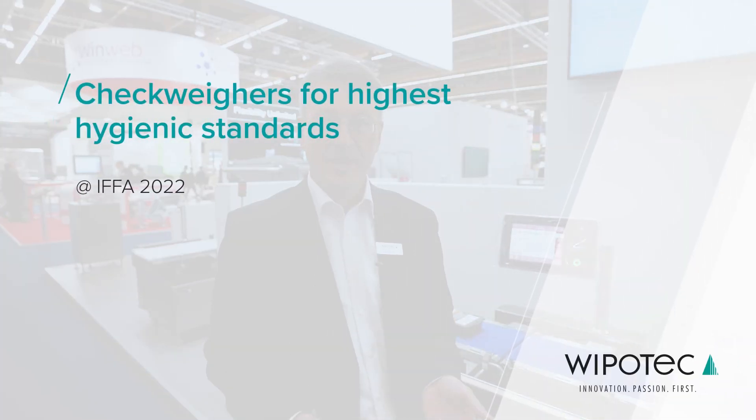That means you're also paying attention to your quality assurance. An important part of quality assurance is to check the net content or at least to weigh your product. You can do that when doing a spot check — let's assume you're doing one every 20 minutes and you take five packs. That means you have 15 packs in one hour. Wouldn't it be better to have an inline check, making a 100% product check of all products, specially adapted to your needs and environment?